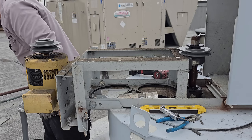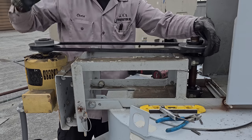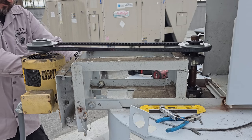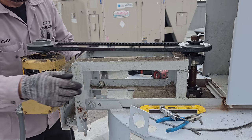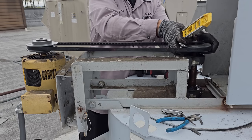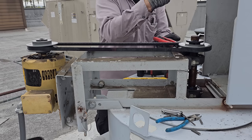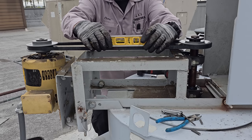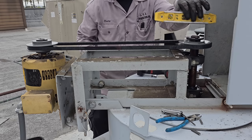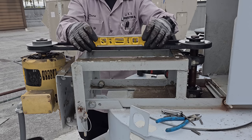We gotta set our pulley now. And I gotta go get some belts. Somewhat tension. Let's go up on this side. There we go. So we're gonna use that as our guide. Now, this shaft is dead level. This one is a little funky, so we do have to compensate for that, but that'll get us in the ballpark.